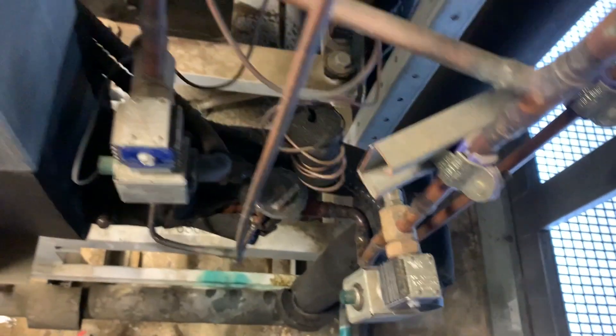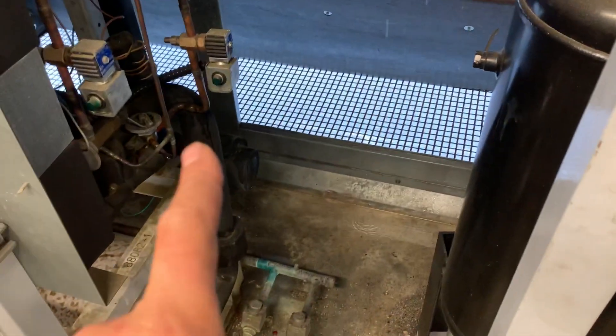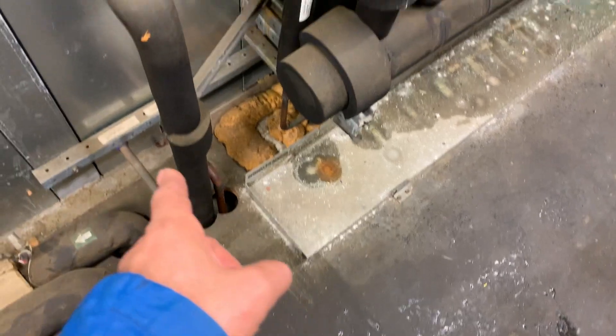And then you have on the other part of the heat exchanger refrigerant being flashed in there through the expansion valves and sucked back out. In this case the cooling circuit is coming from a different rack — so it can come from a different rack or it can come from the same rack.